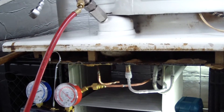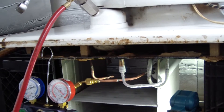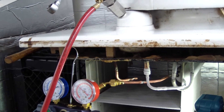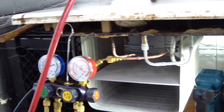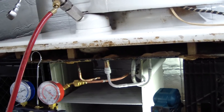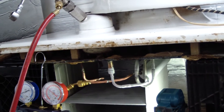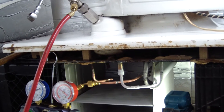I thought, hey, that's great — I've got that thing loose, but I still couldn't pass any nitrogen through it. Tried to pull a vacuum. Tried to push it through from the low side. Push it through from the high side. Anything I could do without going to a very high pressure — I never went more than maybe 115 psi. No bueno there.